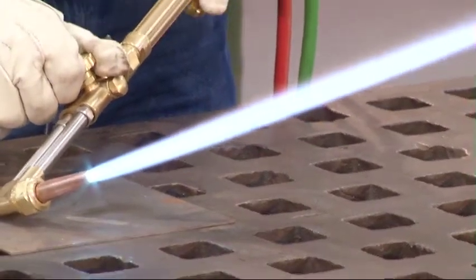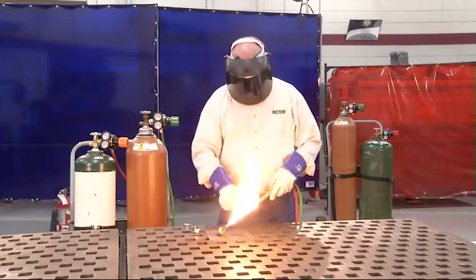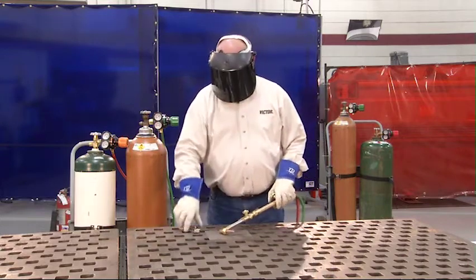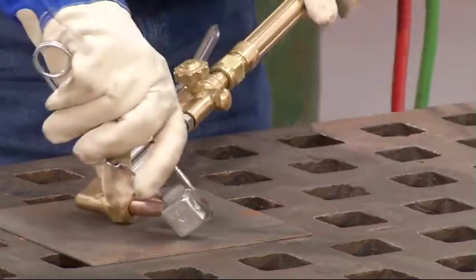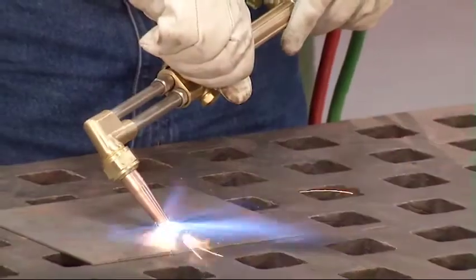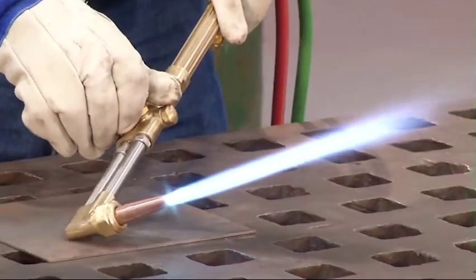You can walk this up to the desired heat. Then shut off the oxygen first and the fuel gas last. You'd use this in most situations. The second technique is to put the torch at about a 45-degree angle, ignite the fuel gas, and add the oxygen. You'll hear it snap back into place, then adjust it to a neutral flame.